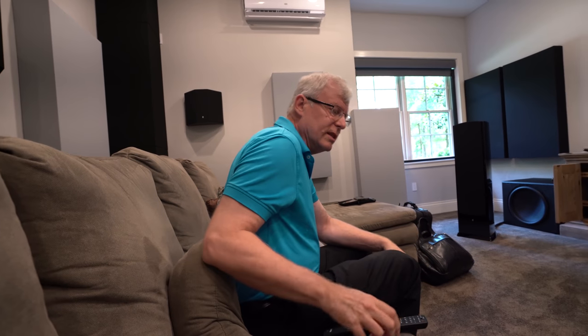So the channel levels, the sub was probably a little hot, and the channel levels were not too bad, but the frequency response of several of the channels was way off. So when I get to that, then we'll readjust it. But this also gave me a feel for what's wrong with it initially. And I heard some acoustic problems too, but I'm not going to be able to fix that. I'll give him some suggestions about what to do.